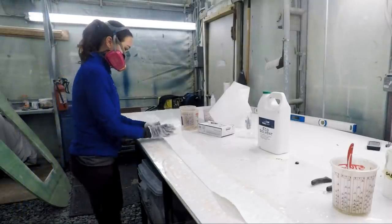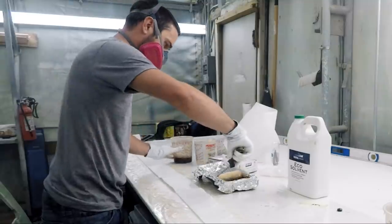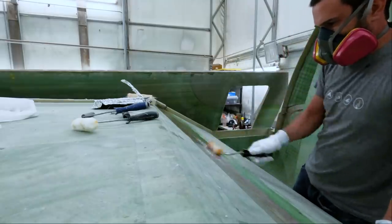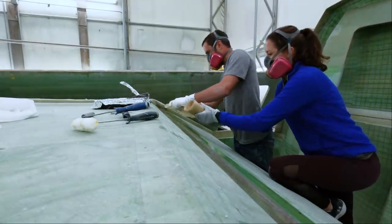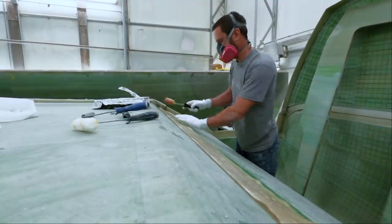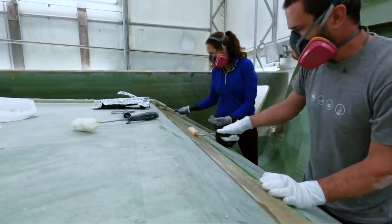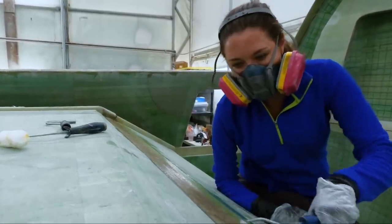Because we were using 1208 fiberglass once more for this project, it required us covering the chop strand portion — its backside — on our wetting table. Even though we still give everything a good coating once it is set in place, this ensures that both sides will be fully saturated. Between the two of us, we unrolled the 1208 across the bridge deck joint, making sure to keep the center of this 150mm cloth right over the seam that had just been coved. Matt would coat the top with more resin, and the motion of pressing in with his roller would help smooth the cloth and remove larger air bubbles. Because there were still many smaller air bubbles trapped, I stepped in with a fin or metal roller to help eliminate any other air trapped under the fiberglass.